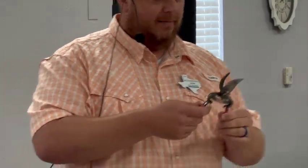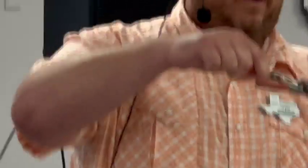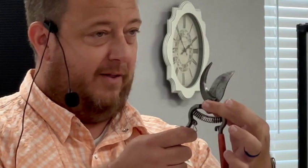So again, flatten the back. Now let's consider the geometry here. Do you guys see where the two pieces of metal touch and interfere with each other? If you flatten here and you don't flatten here, you're changing that angle. So they're no longer going to intersect with each other properly. You have to flatten the entire back from where they touch each other, because if not, you're building in space in there, and that's not going to help you have a nice clean cut.